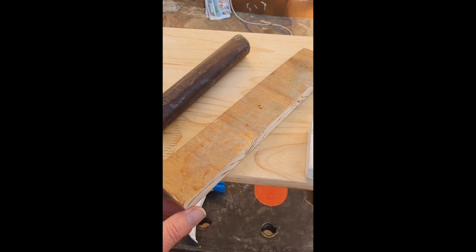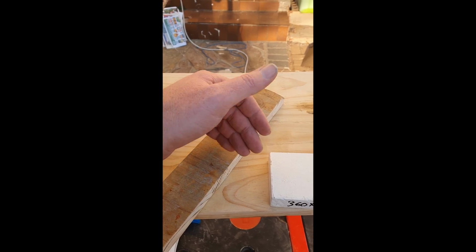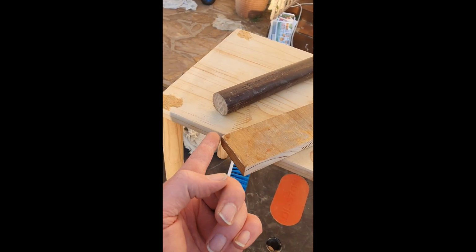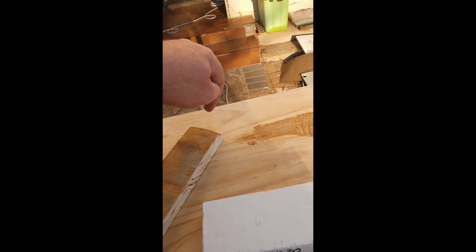The other thing I can utilize this for is, let's say, I cut it in half and I take the two pieces and I clamp it and glue it together. And then I make a small little cut along the two sides, just a little narrow cut. Then I can glue those together, clamp it up, and I can turn that into a sanding block. So I can put sandpaper in the one side, wrap it around underneath tight, put it into the other side, and then I've got a hand sanding block for if I'm trying to work with my hands instead of using one of the tools.